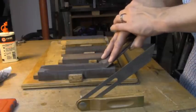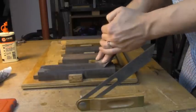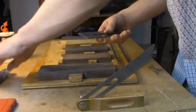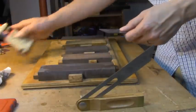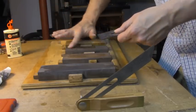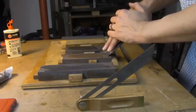This is just like using the abrasive paper - I know I'm done with a particular grit when I feel that nice burr on the back. You can also call it a wire edge - it's the same thing. Once I've got it, I go over to my next stone, quickly move that burr back over to the front side, and then do the exact same thing again - start at 30 degrees and move forward dipping my hand down.